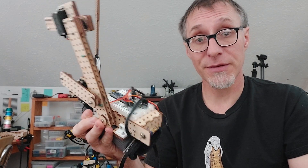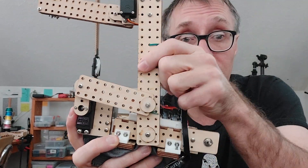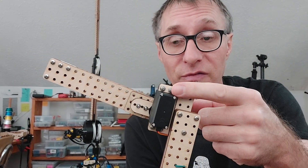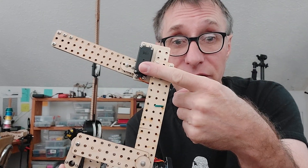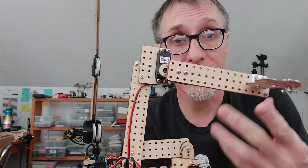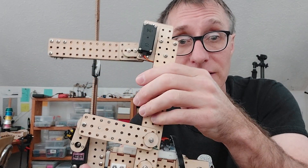It's pretty cheap - a pretty dirt cheap build. But on the mechanics side, one more thing. This hobby servo is driving a linkage connected to this arm, so this arm moves back and forth and all the load is on this bolt right here. Then I did a no-no - being lazy, essentially, just moving forward. I attached the servo to the end of this arm, but now this arm has to carry the weight of this motor. As it moves back and forth, it's constantly throwing this weight back and forth. This end arm is connected directly to that servo, so this servo is carrying the weight of this arm. It has no support, so all the abuse this arm takes goes straight through the shaft. At least the other arm is bolted to the frame so some of that gets eaten up by the box. Definitely want to get the weight off of this arm.